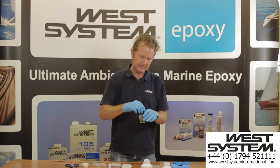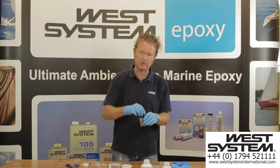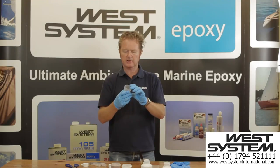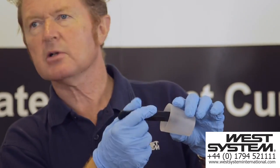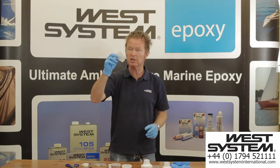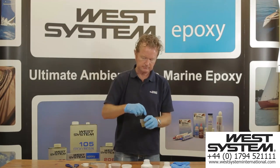Make sure that whilst you're mixing, you mix right into the corners of the mixing pot. It's very important that the next day, when your mixed epoxy has cured, that you roll the pot and break out the waste. If you see a small residue of uncured resin and hardener mix in the bottom of the pot, you're not mixing sufficiently. Very, very good check on your own work. Bit of quality control.